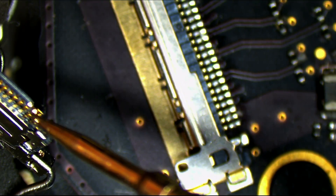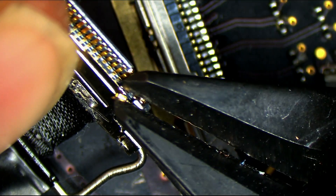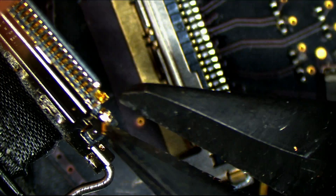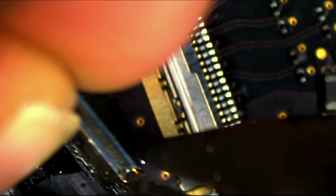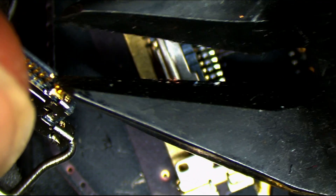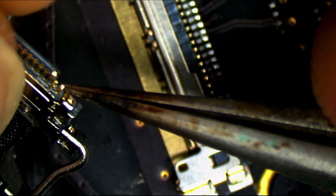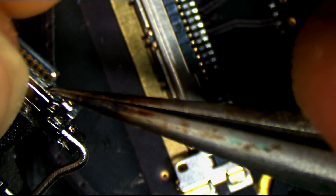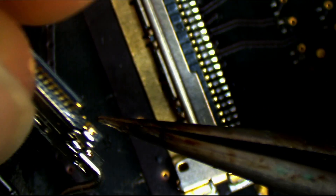Just for fun, I'm actually going to see what happens if I cut those two damaged pins off of the display cable. We're going to take those two pins and cut them out. I'm also going to cut off that endpoint of the connector. I don't care if I break this cable a little because I'm not going to be using this anyway — I'm going to give the customer another one. I feel bad for what the Apple Store did to this computer. Now these two other pins over here, we're going to try to break those off as well. Usually pins one, two, and three are tied together, so while it's not exactly recommended to run all the power through one pin, temporarily it should be fine for our diagnostic purposes. Those are the nasty-looking pins, and we're running them out of there. Look on the other side of the cable — no pin.